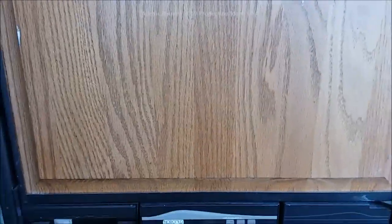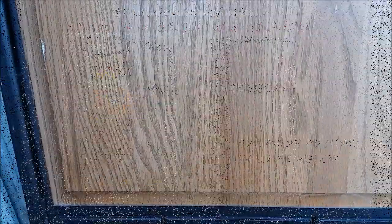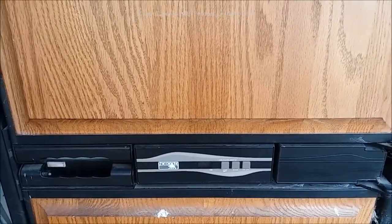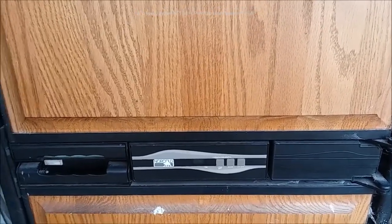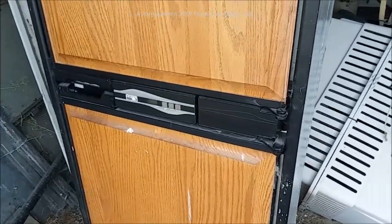My big suggestion if you're going to long-term in an RV is to get a residential-style unit — I'll put a link below the video. It will replace these in size; you can usually get a local cabinet maker to trim-fit the opening, then insulate the back panel closed except for about a one- to two-inch opening. That way you can have a real full-size refrigerator in an RV. This old absorption unit had a leak so we've removed it.